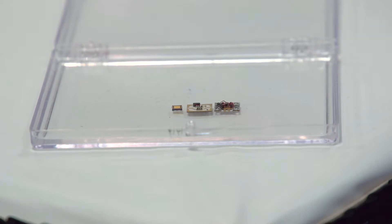We added a couple of extra packaging features, like an off-chip ferrite balun, and put it into the same form factor package so that customers could swap out the old part with the new part, provided the new part could meet all the performance requirements. As it happens, the new part almost always meets the old performance requirement. The part on the far left is a four millimeter package that the same chip can go into, if the customer does not require the same IF bandwidth. So we have two options: the smallest four millimeter form factor package, and the legacy packaged MMIC.